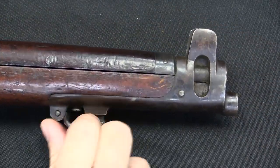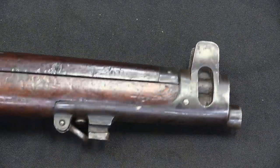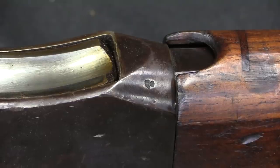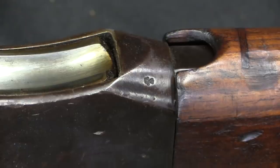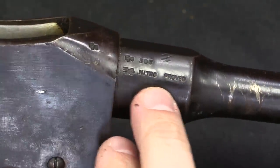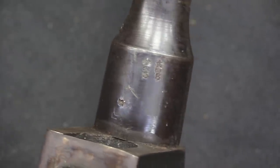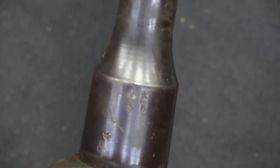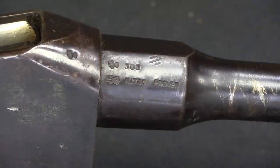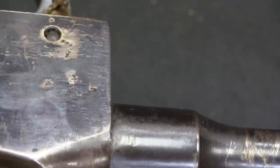The nose cap is authentic SMLE, as best I can tell — it's an early one, a No. 1 Mark I instead of a Mark III, and the shaping is a bit different on these, but that's definitely an SMLE nose cap. As for markings, we don't have any substantial markings except for what's on the wooden stock. We do have one little proof mark here. I'm going to take the furniture off so we can see what's on the barrel. What we have here is another proof — .303 nitro-proofed — and then these two little marks on the bottom of the barrel. I don't know my British proof marks well enough to identify if any of these would precisely specify a time period that could either support or disprove the idea that this was done right at the beginning of or just before World War One.